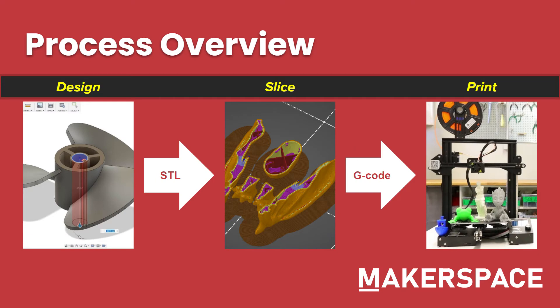So if you've decided that 3D printing is the right option for you, let's go ahead and talk about the process. There are three main parts to 3D printing. The first portion focuses on design. Using this, you'll get an STL model file, which you will then slice. This sliced file — the G-code — can be interpreted by the printer, which will allow it to print your model.